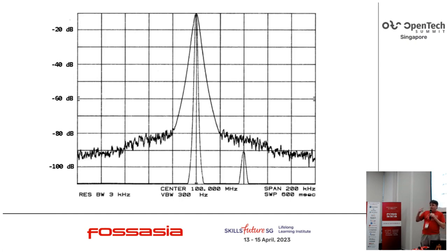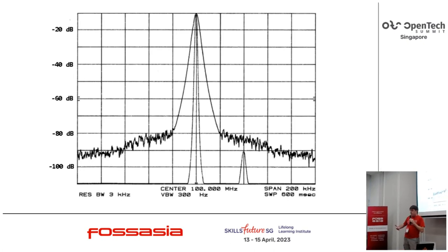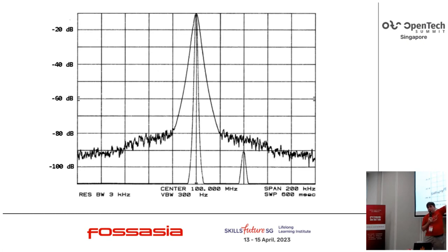However, if the oscillator in the radio is in a PLL, which is used to keep the average frequency right on the line where it's supposed to be, the operation of the PLL continually stepping the control voltage up and down, or the counter ratios up and down, causes noise that looks like this. That's referred to as phase noise. And you can very quickly have more phase noise than the signal you're trying to receive. Regulators state numbers, they don't much care, but as a builder, it's of interest to know that you've made a mistake that's drastically worsened the phase noise present in your design. So there's a whole lot of difficulties here.